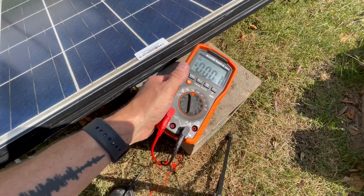And that's it — easy as that. You have to be careful because on some of these voltmeters they have a 10 amp limit. So you don't want to string a bunch of solar panels together in parallel to do these tests, or you're going to blow up your multimeter. If I were to have these in parallel, I would be up over 18 amps and it wouldn't be able to handle that. You could do the test when panels are in series though — your voltage is going to be high, this voltmeter can handle that voltage, and the current would still be around the same.